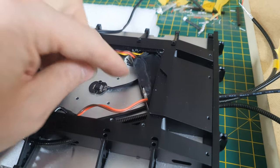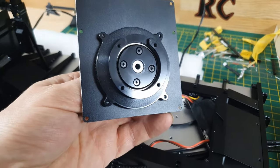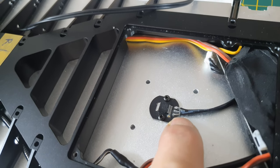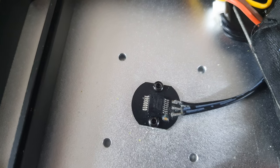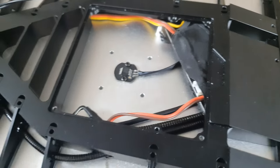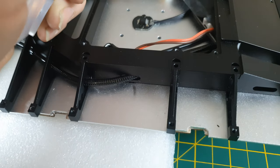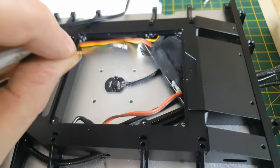That plugs into there and then goes on there. This has got like a magnet under here for the sensor, so it's basically wireless. My wires came off so I've had to re-solder them because they were on with the smallest of threads — it was inevitable they'd come off. I ended up using some de-soldering braid: you put flux on it, press it on, and it just lifts all the solder into the braid, then you cut it off and throw it away.